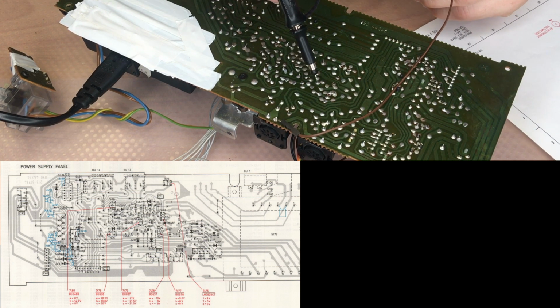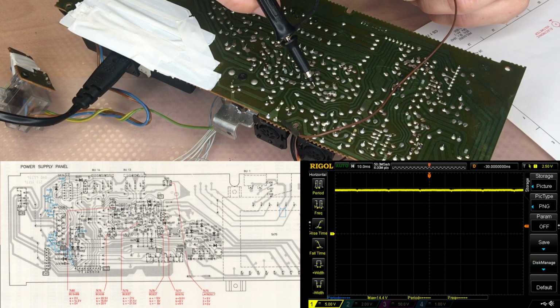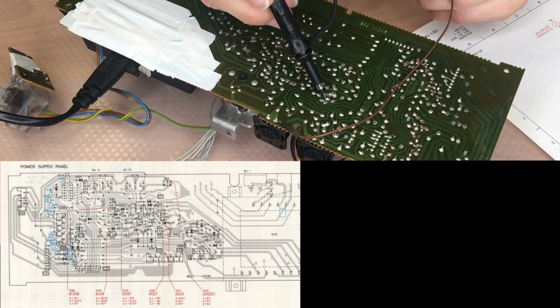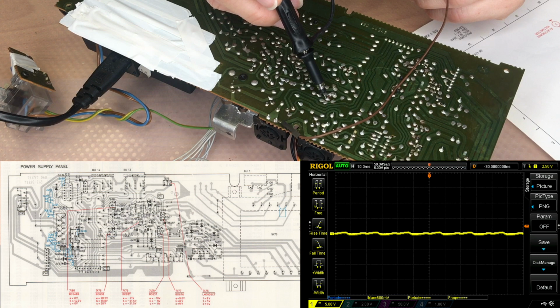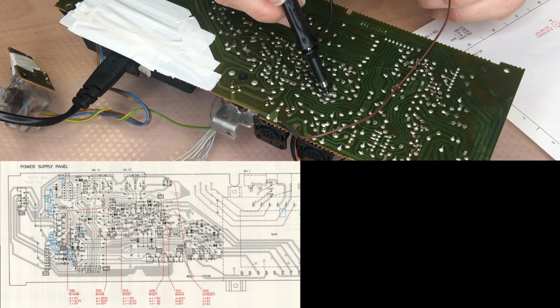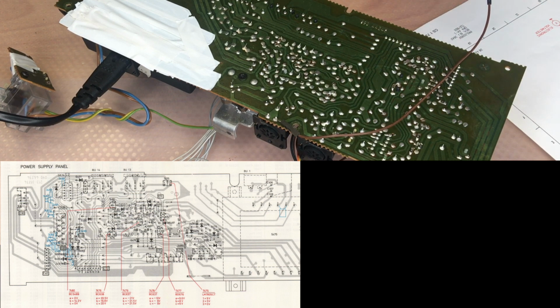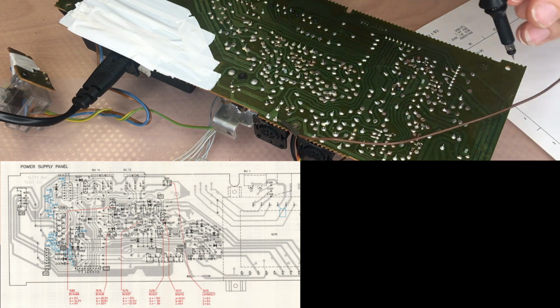Last thing mentioned in the service manual is 7480 up here, collector 0. Oh, 0. No, it's not 0, it's 14.8. Base is 800 millivolt. But okay, I might not be able to switch. That seems to be wrong. And here's 500. Yeah, that seems to be wrong in the service manual, and you need to take care. Sometimes the service manual is wrong. Even there are undocumented parts, and you can see this here.